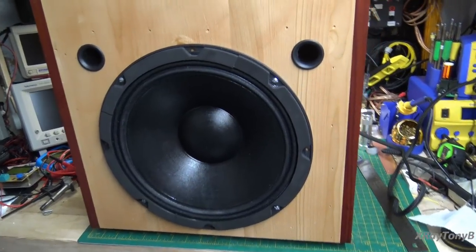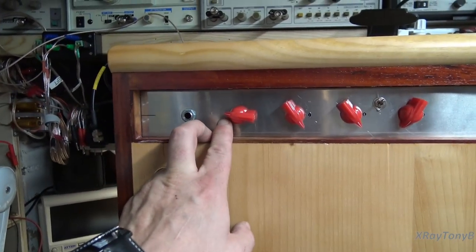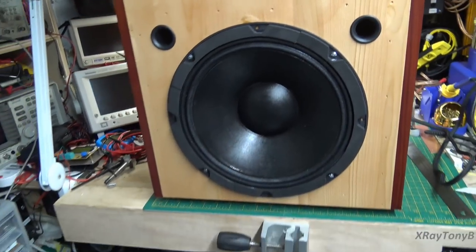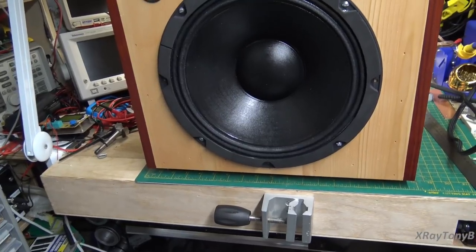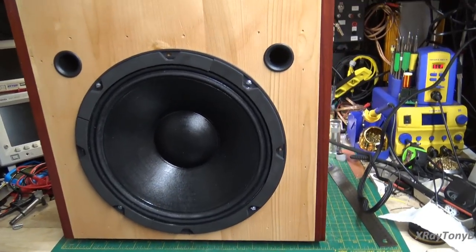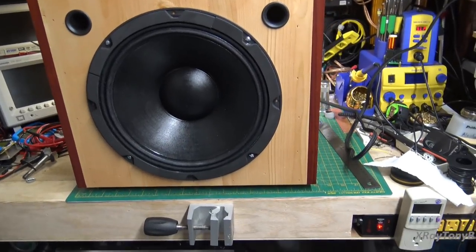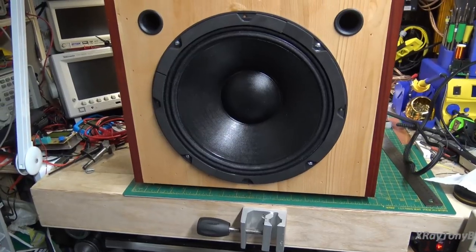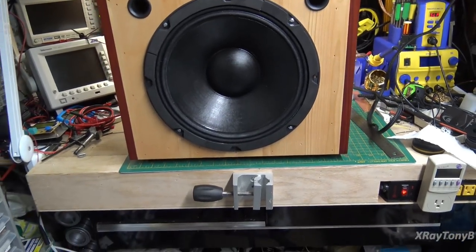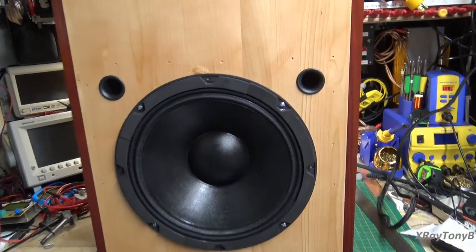It does have some problems I'm going to work on in the circuit. Number one, this amp has entirely too much gain — if I turn the volume much higher than where it is, the amp gets so loud it distorts. I think part of the problem is my bass guitars — I have a four-string and a five-string fretted — both have active electronics, meaning the pickups go through a built-in preamp circuit requiring a nine-volt battery. That gives a much higher output than a passive coil and magnet pickup, and it's way too much gain.